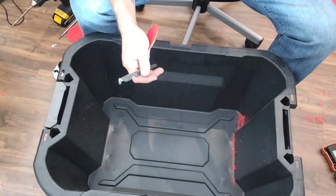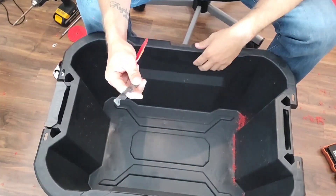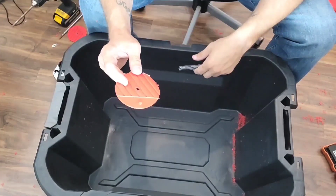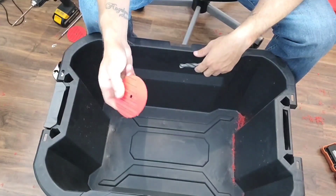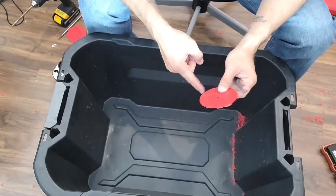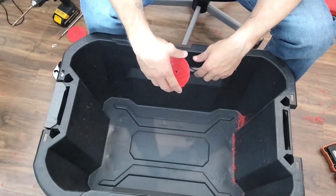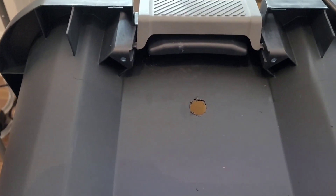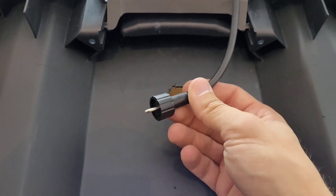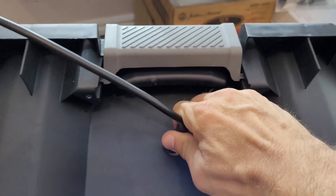Obviously that's gonna cause a leak if left alone, because the diameter of this cable is far less than a half inch. The workaround I'm going to use is this plug that came out of the lid from the hole saw — that's gonna be what the cable goes through. I'm just gonna make a slit here and then use this as a patch over the hole with silicone, and that should prevent any leaking. You can see I've got the half-inch hole drilled into the side up by the handle — it's just enough space to fit this plug through, you can just jam it in there.